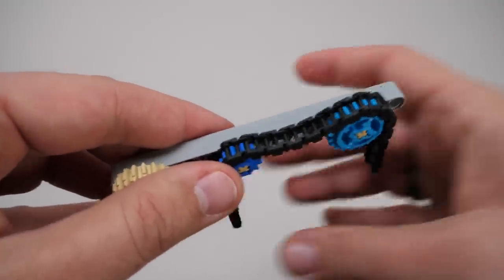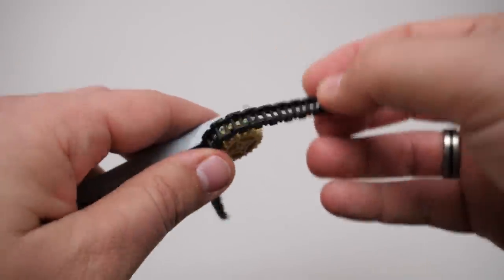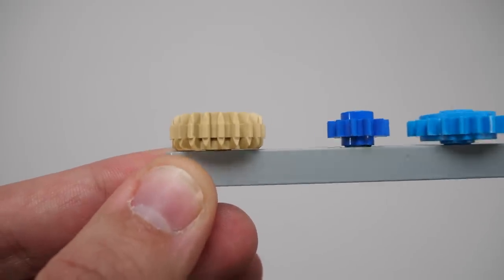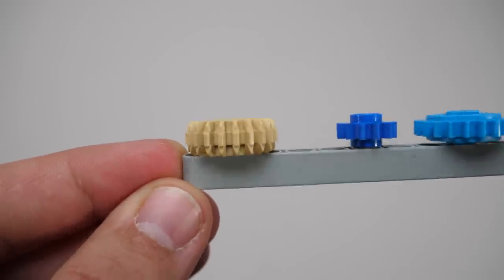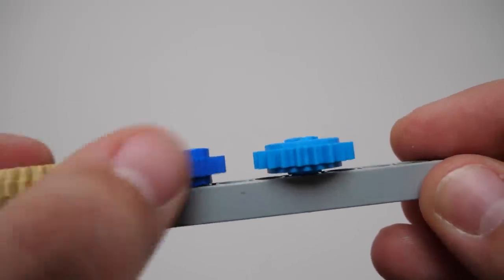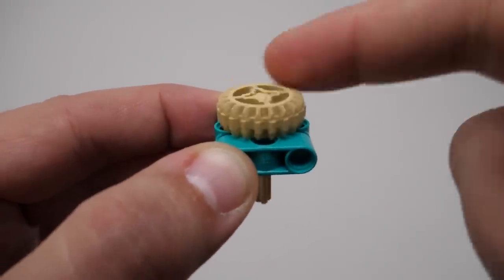About the advantages — it might require further testing but I have 2 theories right now. The first is that these work with chains and the bevel gears don't — seems like a pretty niche usage. The second one is related to the shape of the bevel gears: they have a plain surface on the side, which means the whole surface rubs against adjacent parts, potentially increasing friction and wear. The new ones however have a protruding central section around the axle hole, so only that section is in direct contact with surrounding parts — this means less friction, less wear, smoother operation. You can even hear the difference; the new one sounds much better.